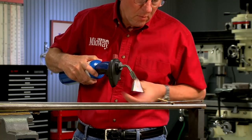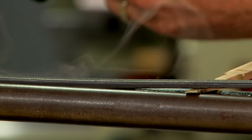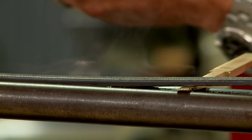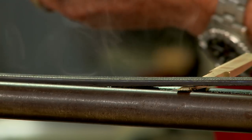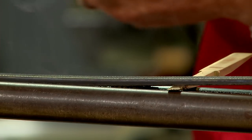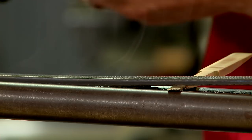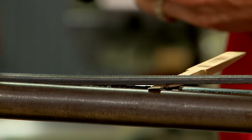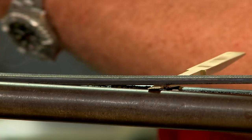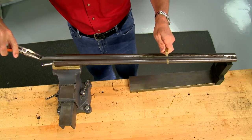To remove the rib, I use a propane torch with a medium flame to heat the barrels and melt the solder. As the rib comes loose, a small wedge is inserted under the front of the rib. I continue to heat the barrels and as the solder melts I gently slide the wedge in further, which lifts the rib without bending. If the rib was loose at the muzzle, it is sometimes possible to make the repair without removing the entire rib, but in this case I need to completely remove it.